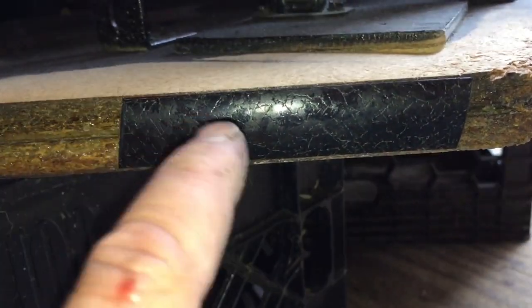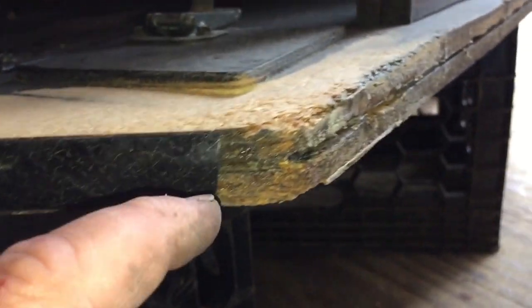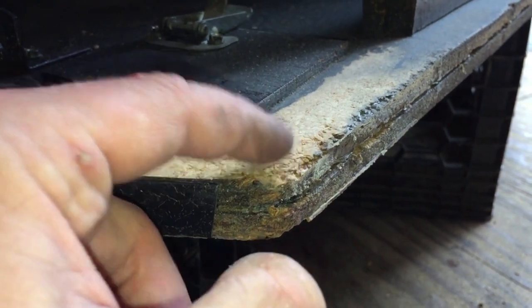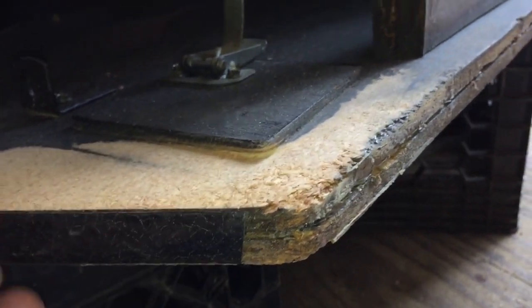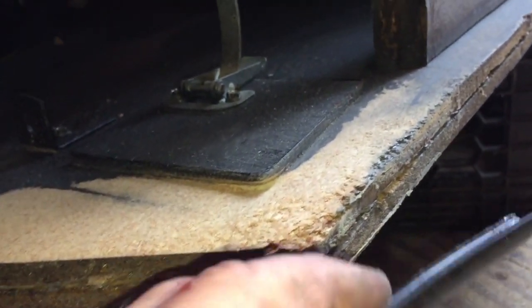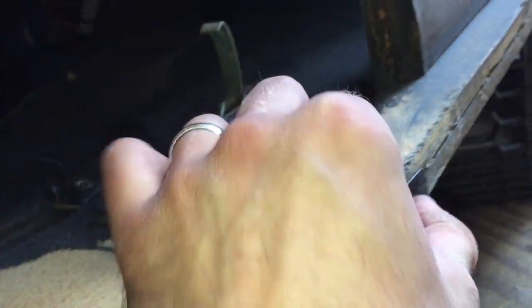But anyway, what I'm doing is I'm sanding, and I put a little piece of T-molding here. I've already done wood hardener. I've already hardened some stuff up. This little corner here is probably going to need a little bit of regular Bondo work just to clean it up a little bit. I'll put a little more wood hardener in there. It is still a tiny bit soft, but I've gotten it much better than it was. If you'll remember how horribly swollen it was when we started.